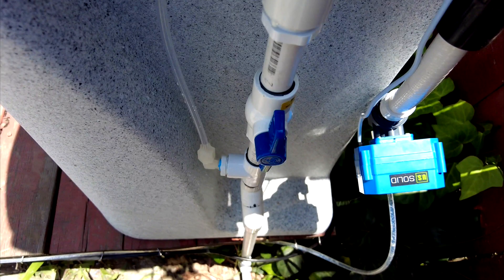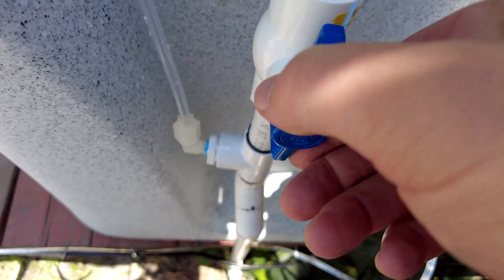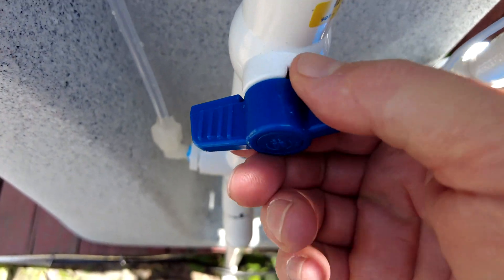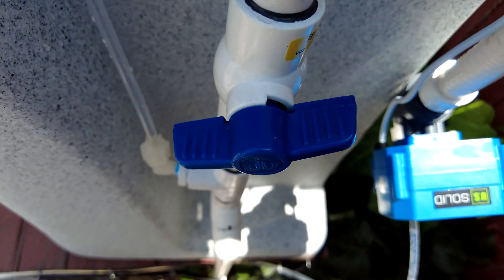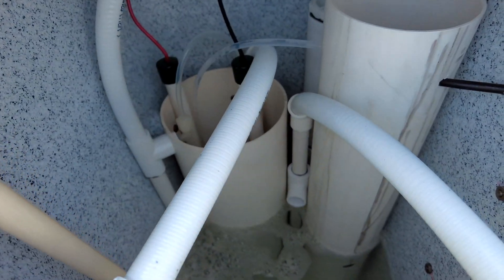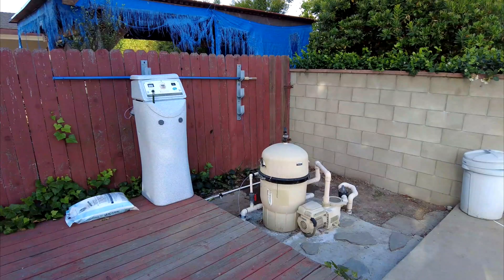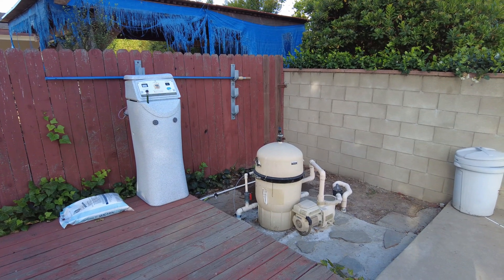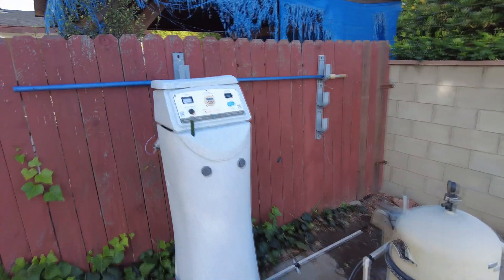Another great benefit of the Chlorine Genie is that it regulates the pH in the pool using this pH drain. You'll no longer need to add muriatic acid to lower the pH or soda ash to raise it. One side effect of a salt water generator is that it produces sodium hydroxide. With the Chlorine Genie's pH drain, you can release some of that sodium hydroxide to lower the pH. Set up the pH drain to discharge into a safe area — dirt, gravel, or a drain — not into grass, a planter, or onto cement, as the high-alkaline water can cause damage.